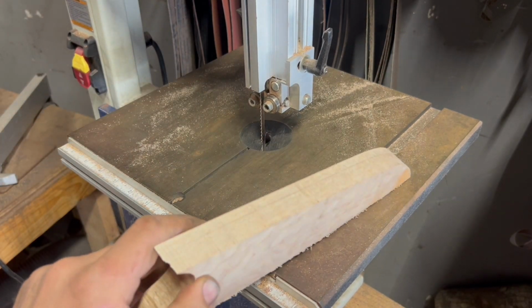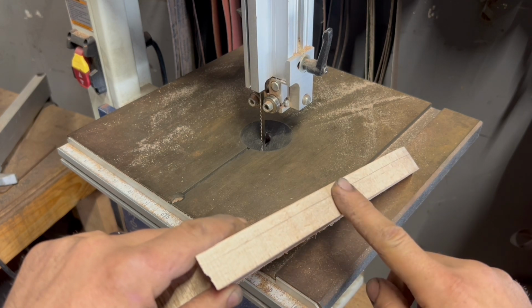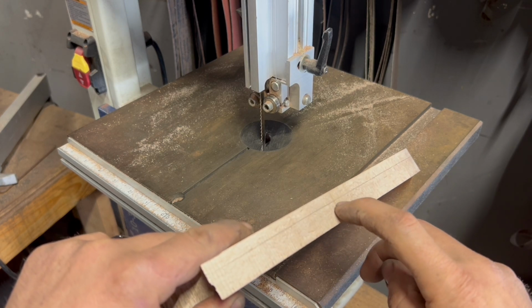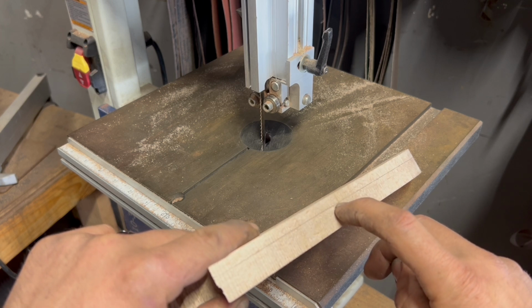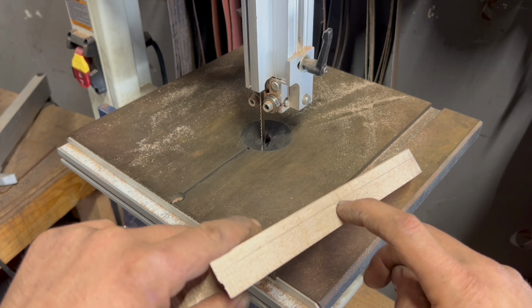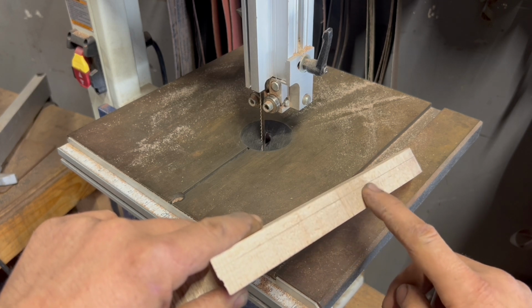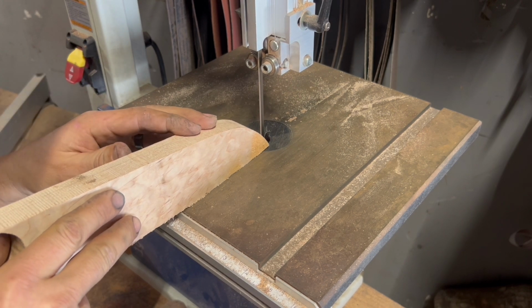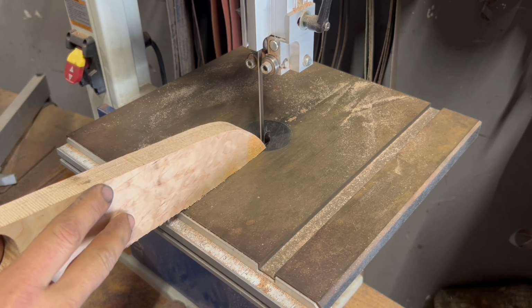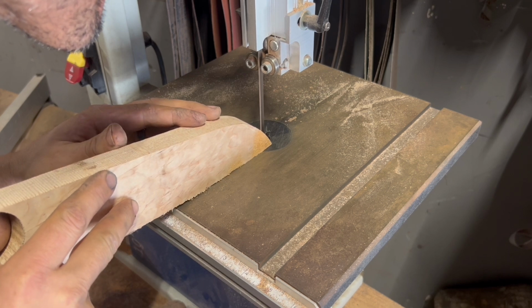At this point, I trace a line that is half of the thickness of the material plus the thickness of the blade times 1.5. I don't want the joint to be exactly in the middle because if there is any residual glue at all in the joint, it will ruin the fine edge of the blade, being the glue quite hard on edges. Cleaning the glue 100% from inside the scabbard is almost impossible, so it's good practice to place the joint offset.